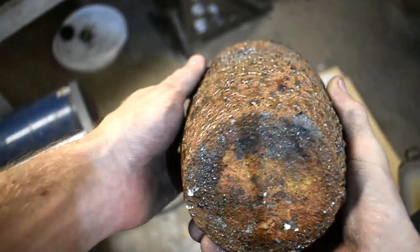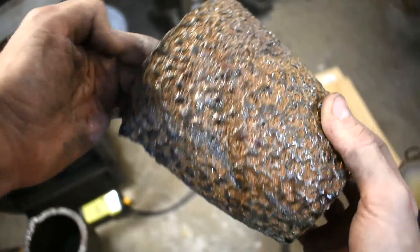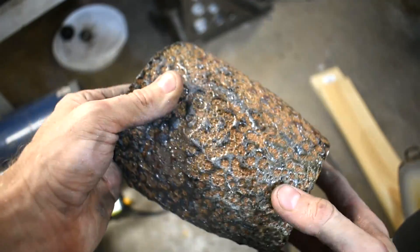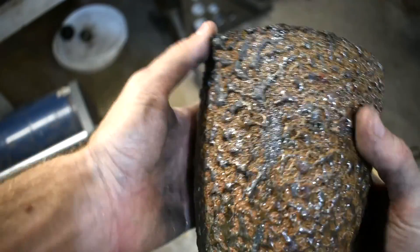While this one — same crucible, same company, tempered the same way — I was using it for the silver melt. Remember when I did the silver sword, and then the copper ones and bronzes. So this one sees higher temperatures, and just look at that thing. It's looking considerably more corroded, and the inside is also rougher and nastier. But this sees temperatures 500 to 600 degrees hotter and it's done it multiple times. If this thing were treated with a buttload of borax, it would probably not be holding up anymore.